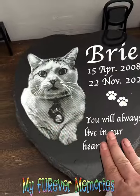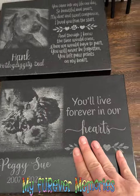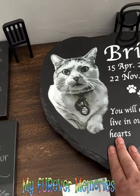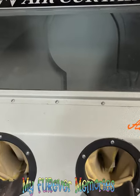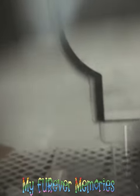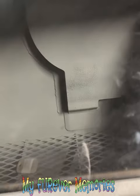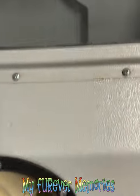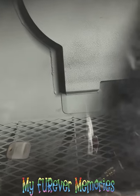We put a special film coverage onto it. We do the same exact process that we do with the laser engraved plaques, but we do more than that. After we've done laser engraving it, we introduce it to this machine — this is a sand carving cabinet. With the sand carving cabinet, we have this hose connected to a high-pressure air tank. There is tons of sand in here, so when it's on, the sand pushes out of the hose onto the granite. And whatever is not covered with that special film gets blasted.